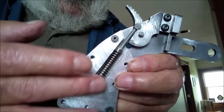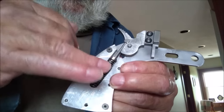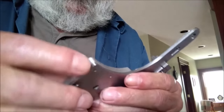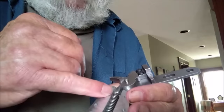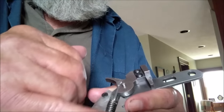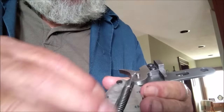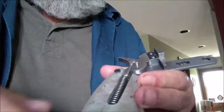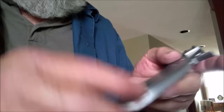I've got a connecting rod running down to the spring, with a little stop on there that actually pulls on the spring. There's a slot cut in a quarter-inch thick aluminum spacer. I'm going to have to relieve the side pieces a little bit, because my spring is a little bigger in diameter than a quarter inch — so I'll just have to grind a couple grooves in the inside of the side plates.